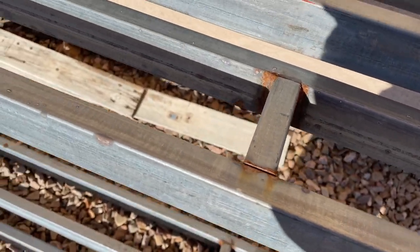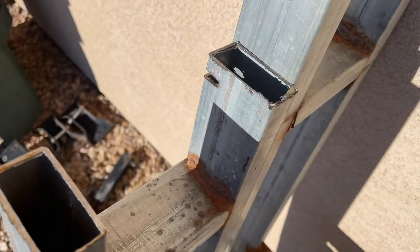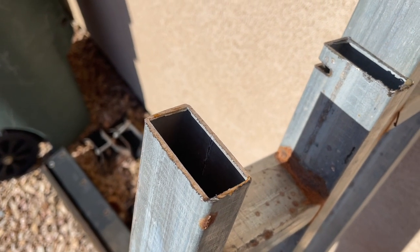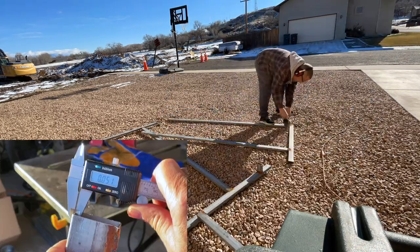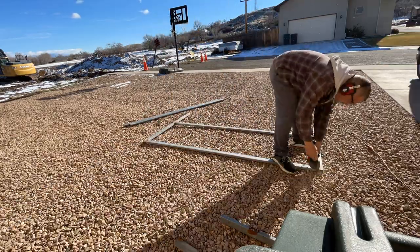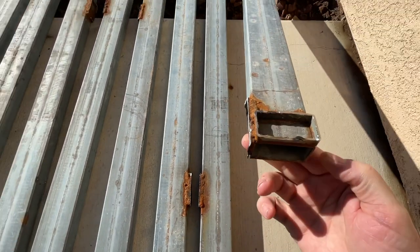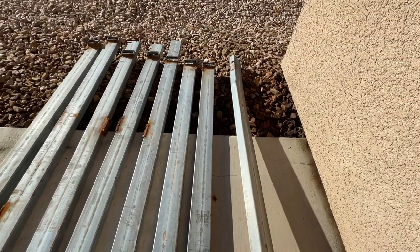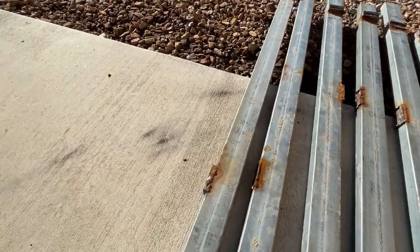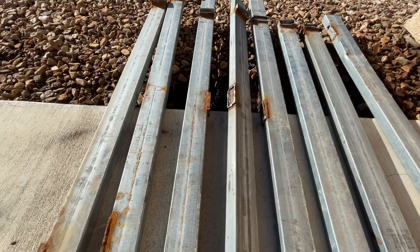In this video I'm going to use some tips and tricks for flux core welding to find the best method for welding this thin-walled galvanized steel tube. I picked this up from an old pallet — it's very thin, 18 gauge, 0.052 inches, about 1.3 millimeters. It was around seven dollars for about 80 feet of usable one-inch by two-inch galvanized thin rectangular tubing.